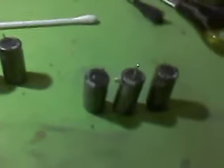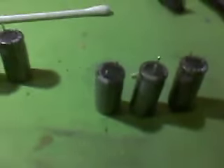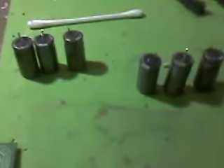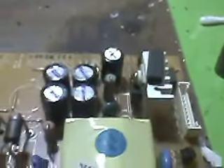I think the guy who did another video about this particular monitor must have had an older monitor, because his board layout was different to mine. Looking at the PCB layout, where the capacitors are positioned is different. He had his power socket leads at the top of the board, whereas on mine the socket is on the side — so he must have a different board revision.